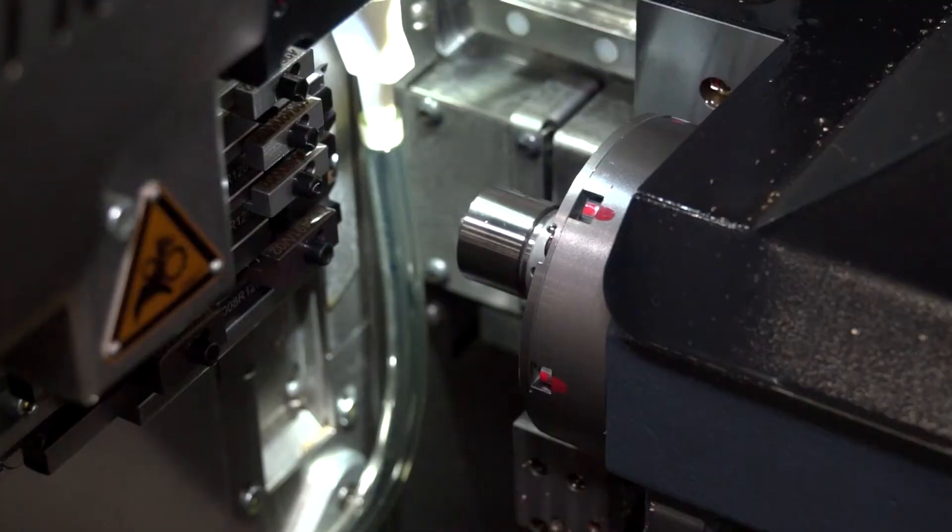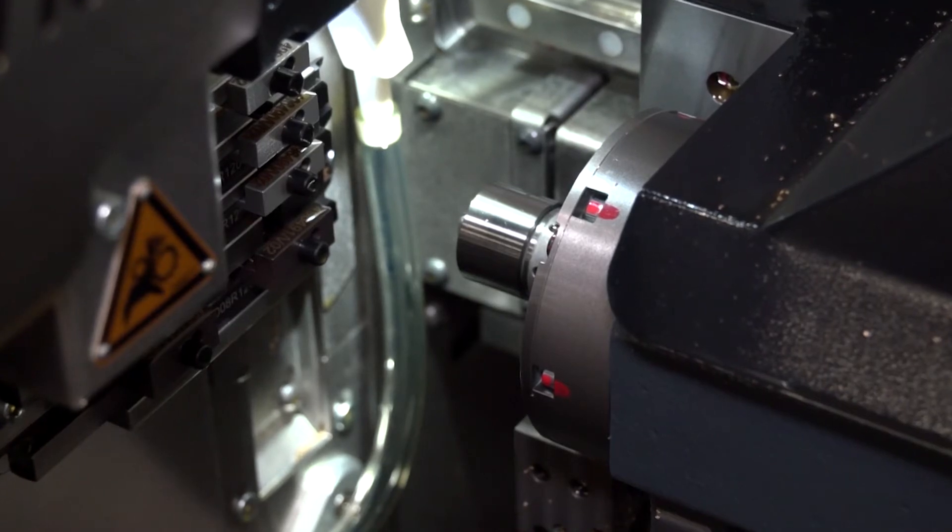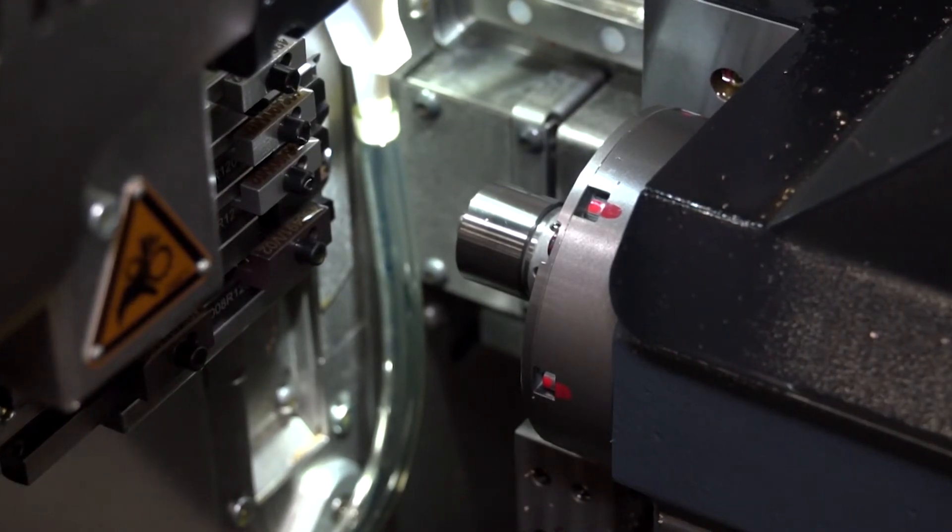With a machine like this doing very small parts, you need to maintain accuracy. What would be the repeatability? For watch market applications, you can imagine the precision needed in that industry. We are able to hold plus or minus one micron in production on typical watch applications, and those are the needs of Swiss watchmakers.